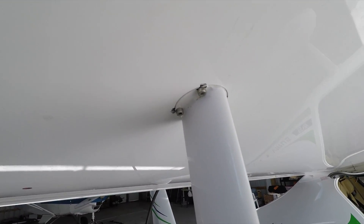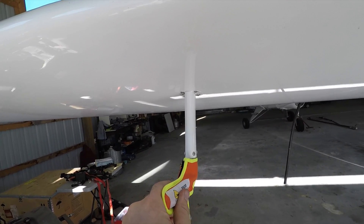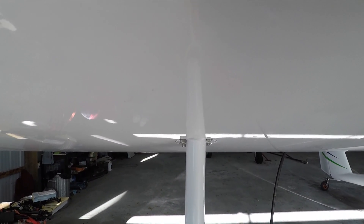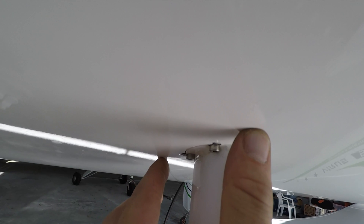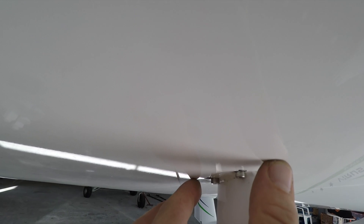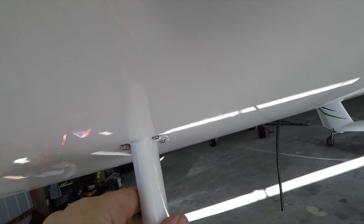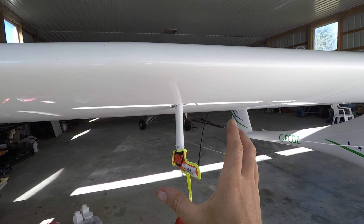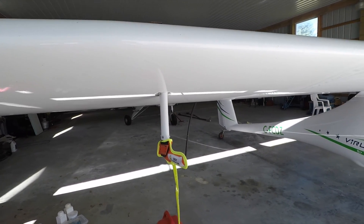All fixed, and it's better than factory. Look how strong this thing is. You can see it moves the wing inside a little bit — there's a plate in here that's about this long, some pretty thin aluminum. I have the nutserts installed on the plate and then some long bolts bolted up through there. It's really strong, I'm happy with it. If you guys have any comments about what to do to protect this so that if I hit something it won't damage the pitot tube — I know I'm in and out of here a lot and it's really easy to hit.